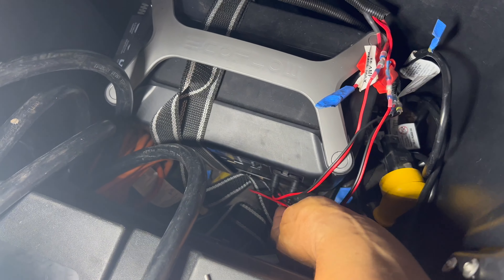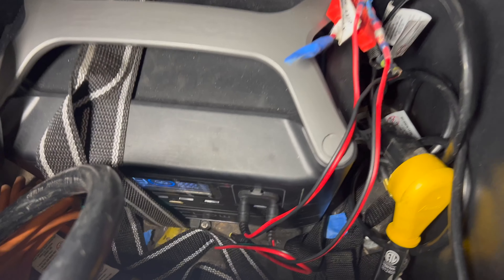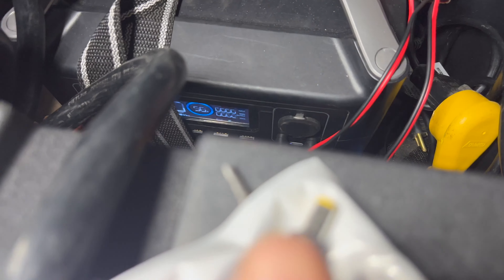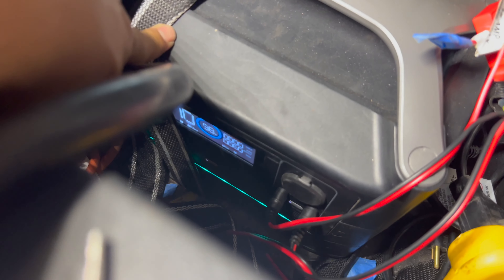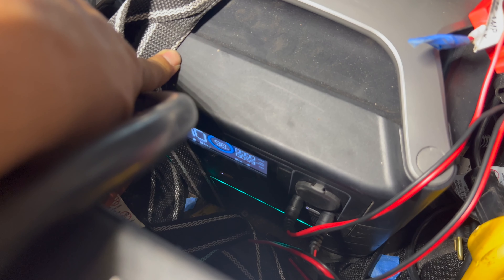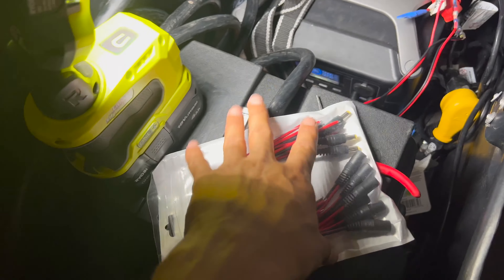The EcoFlow has separate main 110V AC outlets where the fridge is plugged in, and I can power that separately to run the fridge. So I can kill the trailer completely but still run the fridge. I can turn off the mains and still have the fridge and main lights running. You can see the watts being drawn — 66 watts, 62 watts. At 98 watts total, the whole trailer with fridge and compressor running will last you 10 hours — perfect for a full night.